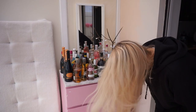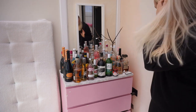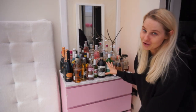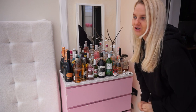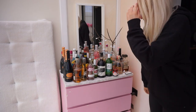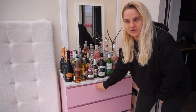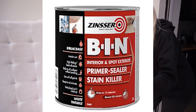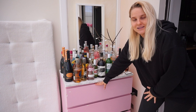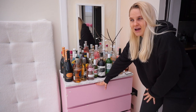So I'm going to be upcycling Ikea MOPPE drawers. These are the MOPPE drawers. To upcycle Ikea furniture, you need to use a primer — I use Zinsser BIN — and then I like to use a satin or eggshell based paint on top to make sure that it's wipeable, and then maybe a varnish on top. It depends what paint you're using really.